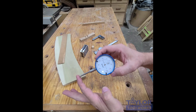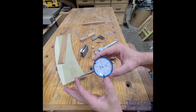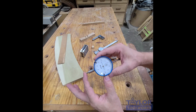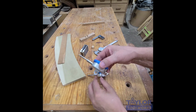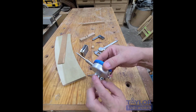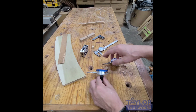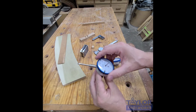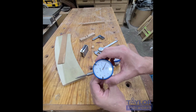There's about one inch of travel on this indicator — maybe a little more like 1.1 inches — and the accuracy is one thousandth of an inch over the whole length of plunger travel, which is pretty good for the shop. On the back there's a lug with a hole so you can attach it to different things to make it more useful. This one is attached to a small magnetic base. I'm going to show you three common uses of the dial indicator in the shop.